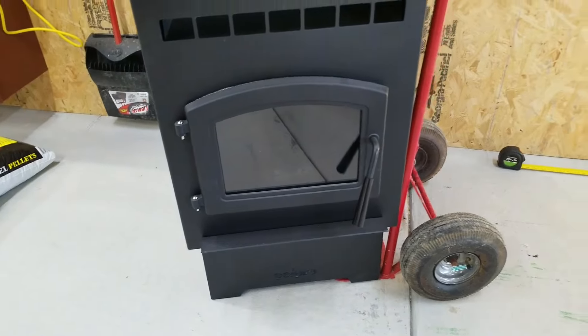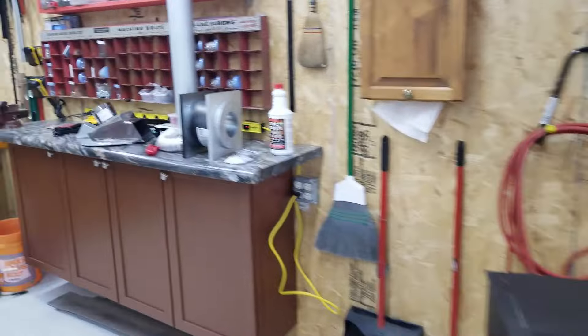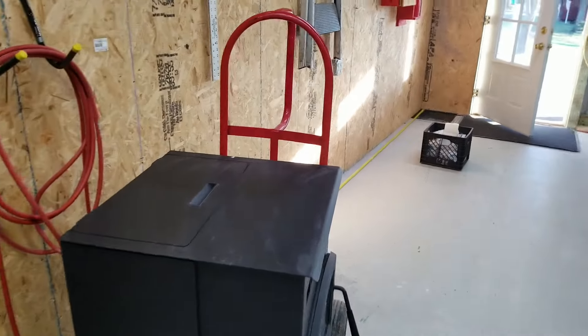Here's the little unit — it should be a pretty easy install. We're just going to have to use a hole saw to get a hole through the wall all the way through to the outside. We'll be using some double-wall insulated chimney pipe to get it vented out. Since this is power-vented with forced exhaust, it does not have to go all the way up the side of the building for draft like a normal chimney. We can just go straight out and put a little rain cap on it — should just be one hole through the wall. This building isn't tight enough that we have to worry about getting a fresh air vent in also, so it should just be the one hole, hook it up to some power, get it all caulked up with some heat-proof silicone and we'll be ready to rock.